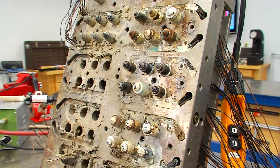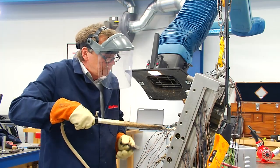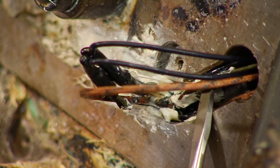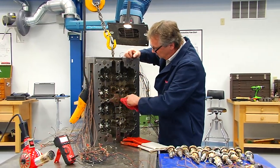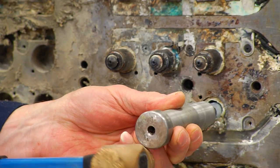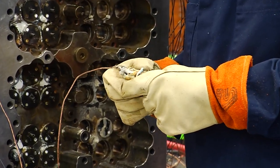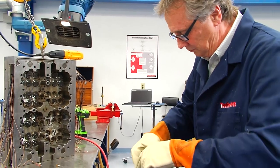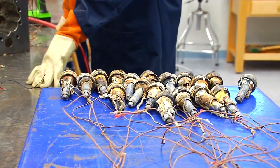There are disadvantages to an in-house repair. It can take 40 man hours or more to completely clean and rewire the system on a typical 48-cavity mold — even longer if you don't have the proper equipment. Cleaning and repairing an encapsulated system also requires a higher skill level to troubleshoot, clean and reassemble without further damage. Failing to do this correctly can cause the system to flood again. Many hot runner manifold problems can be traced back to a lack of knowledge concerning hot runner assembly mistakes, poor work habits, and improper tools used during the clean and repair of the manifold and critical components.